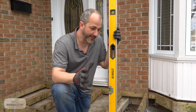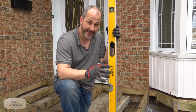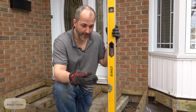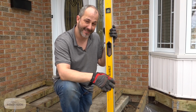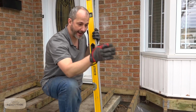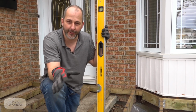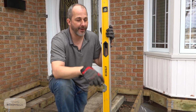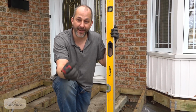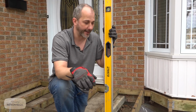So we're going to talk real quick about structural framing for decks outside. And there are two kinds of decks that you can build. One is where it actually has structure and footings and is attached to the house, which means you're actually attaching to the building and all of your posts that are going to the ground are down into a footing that goes below a frost line if you have one in your area, or it's in something solid that's not going to be in direct contact with dirt so it doesn't cause rotting and premature dropping of your deck.